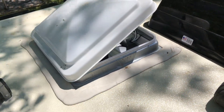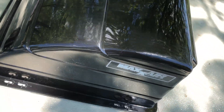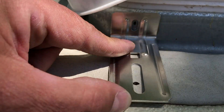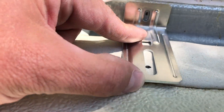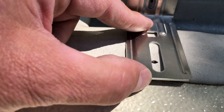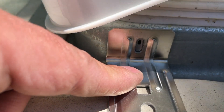That's really all you need, plus something to mark with. Center the vent cover up over the vent, then go ahead and put a little mark in the center of each of these slots. You're only going to use one slot on each end, but I go ahead and mark both of them. Then take your bracket and center it up side to side on that long slot and mark on the flange.